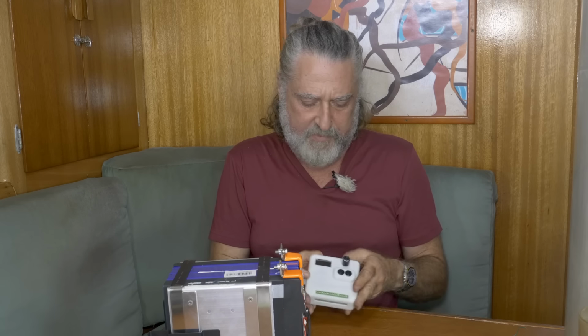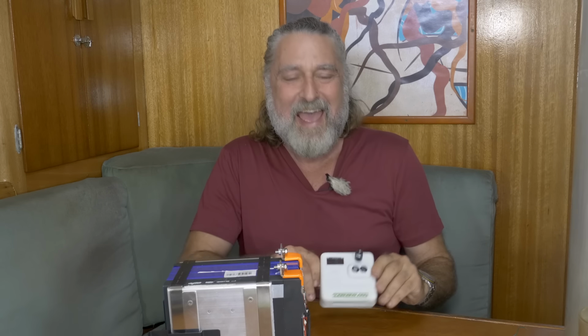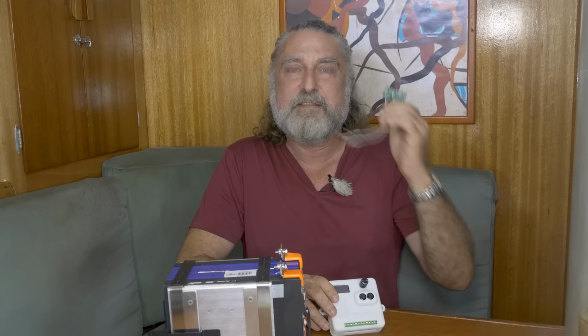So you might want to periodically take your bank manager out of charge to 100% mode, where it should be most of the time, and put it in charged voltage, and then give it a slightly higher voltage and let the battery come up into that scary territory. That will let the balancer balance.